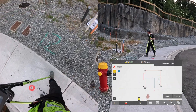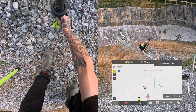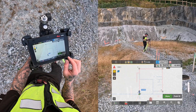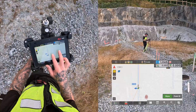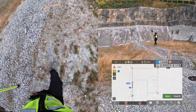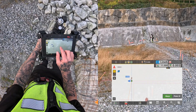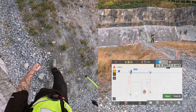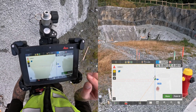To give you an idea of how accurate this is, I can check how the linework sits over the survey pins. When laying out this line, it shows it's 2mm out one way and 0mm the other way. Then 3mm one way and 2mm the other way. Then 2mm and 1mm.